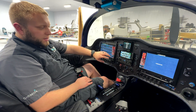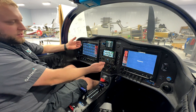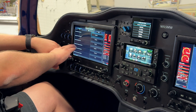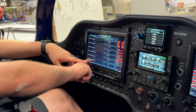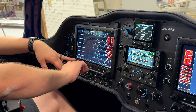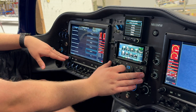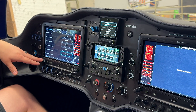The next one is the autopilot controller. The GMC 507 actually has an AHRS built into it, which enables the autopilot to cross-check the AHRS data being fed from the G3X system to make sure everything's correct. On the autopilot page in configuration mode there's an option called flight control system monitors — make sure that's enabled, and then you get two extra options. The first one says mode control panel pitch/roll — we hit calibrate and that's it, it's that fast. The next option is the control panel yaw offset. In the Sling, the unit is flat to the yaw axis of the aircraft, so we don't need to adjust that.